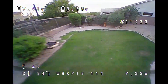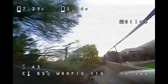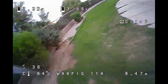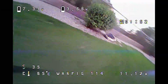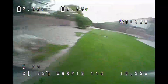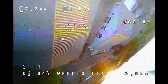If we can't get that MPU 6000, this is a really nice gyro. The key here is with that super low filtering, we've got crazy low latency, and that really lets these props come alive. You can still hear a little bit of prop wash, and I couldn't completely get it out, but it's really close. The reason we can do that is because of the low latency - that's what gets rid of the prop wash and lets you run high D without smoking the motors. That's the real key to this build.